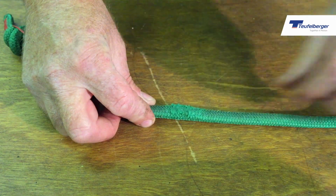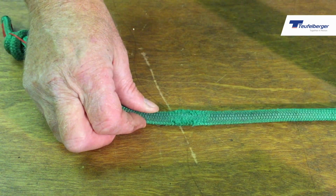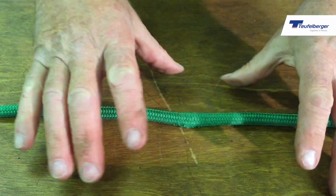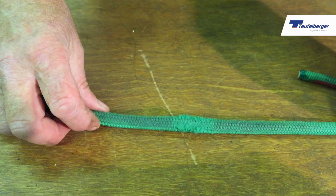Now, this is most likely caused where the climbing rope has been left on the ground and somebody has chopped down a piece of wood and you've landed a piece of wood on this and it has impacted over something hard on the ground. Never a good idea to leave your rope in your drop zone of any timber or anything else coming out of the tree.